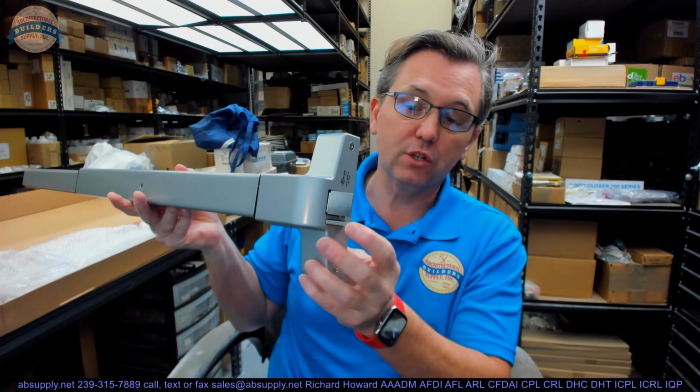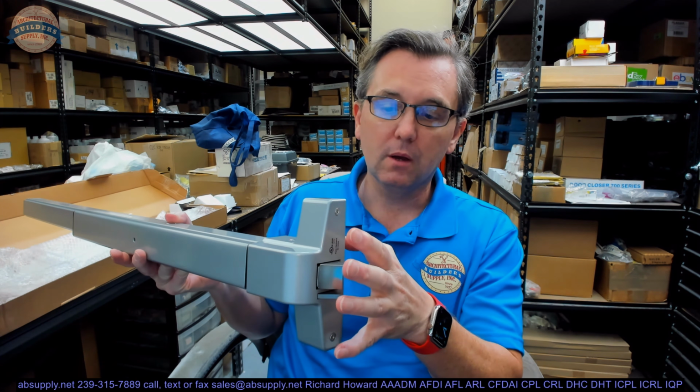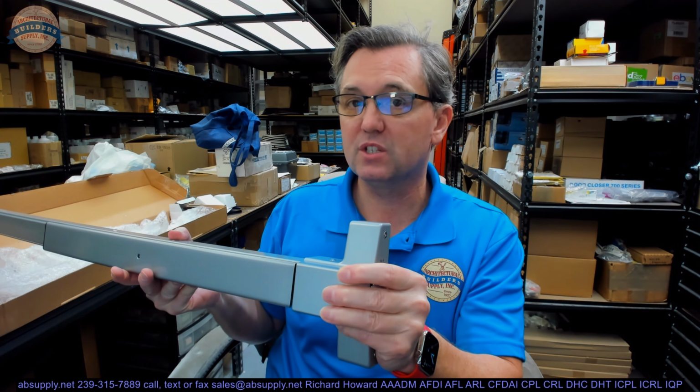That means everybody who's participating in that fire test has to retest. And what I mean by that is you'll have the door manufacturer, who's probably the frame manufacturer. You'll have the hinge manufacturer. You'll have the closer manufacturer. You'll have the exit device manufacturer. So if any component in that fails, it has to retest. And I have been told that a hinge manufacturer and a closer manufacturer will all come together to test the assembly and then share the cost. And what I've also heard is that if the panic device manufacturer's device is the cause for the failure, they have to pay for the next test. Anyway, regardless of whether or not that's true, the fact of the matter is there's no question that this design contributes to the ability of this to survive such a test.